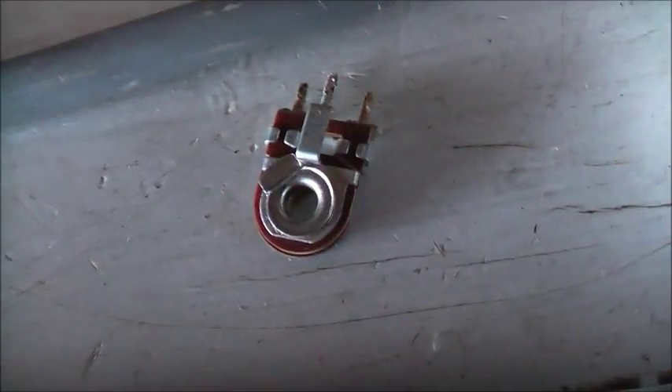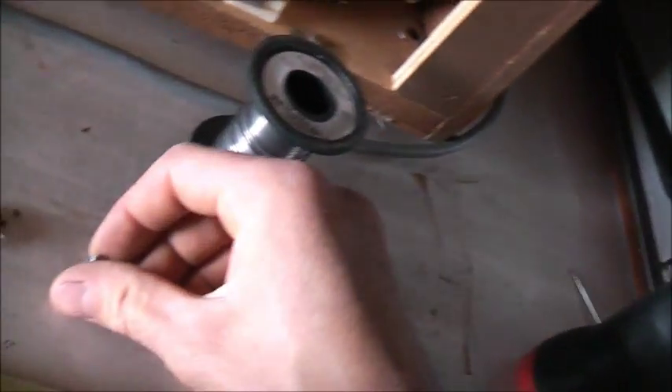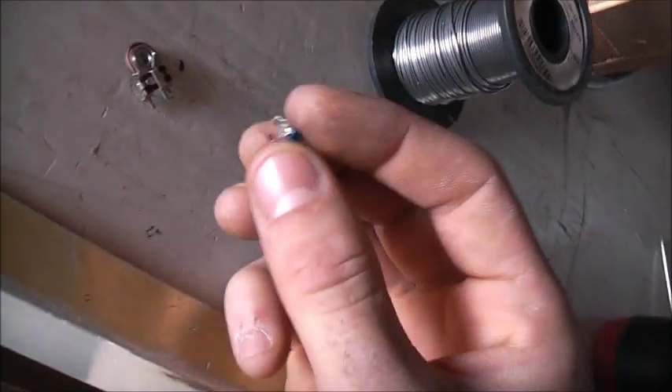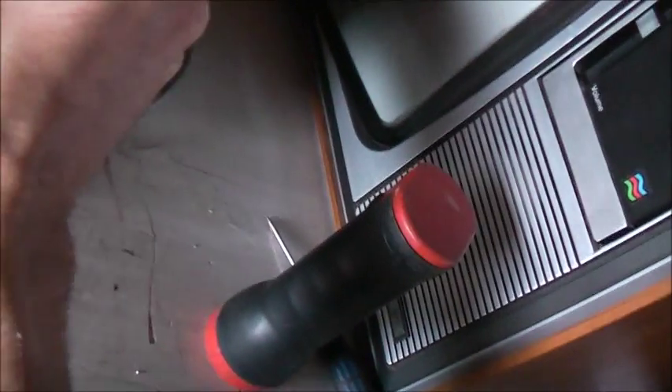Let's see if I've got a replacement for one of those types of parts, hopefully the same value. I found a modern one — 502 is the part number and value. I just happened to find another one here in an old blown-up switch mode power supply from a battery charger. So keep those old bits and bobs — never know when you might need them. The footprint should still be the same; it's all physically the same connections, you've just got to orient it differently. It's near the flyback, so you've got to be very careful not to shock yourself.